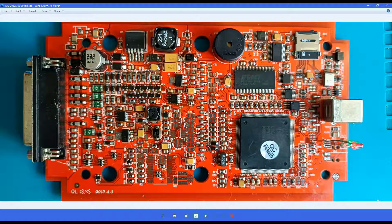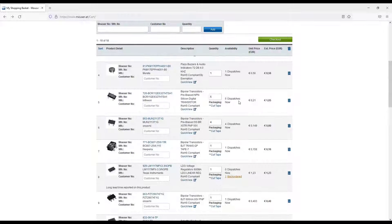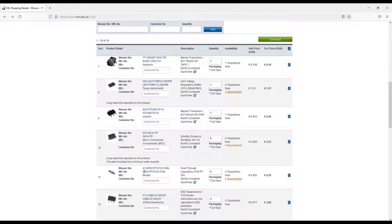I hope the quality of the picture is good so you can see without problems what I will explain. Here we have holes — you should solder all of them on this line, and also here where the USB is. After you fill these holes, you move to the first step: these filters. I forgot to put the name of this component here, but we'll go on the list and you'll see — this is 4.7 nanofarads. Here is the list and as I said, filters are over here — this is the number.